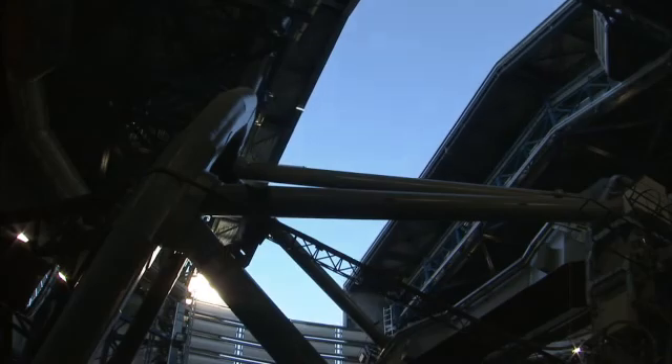Although this happens quite regularly, this is far from being a routine procedure. Under the open sky, dust collects on the surface of the mirror. And although this layer of dust is very thin, it nevertheless degrades the quality of the astronomical observations. So the mirror must be cleaned regularly — in fact, it must not only be cleaned, it must be recoated, meaning that its thin layer of reflective aluminium must be replaced. The ESO technicians and engineers must work both quickly and carefully to complete this operation on the fragile 17 cm thick mirror in order to limit the telescope's downtime.